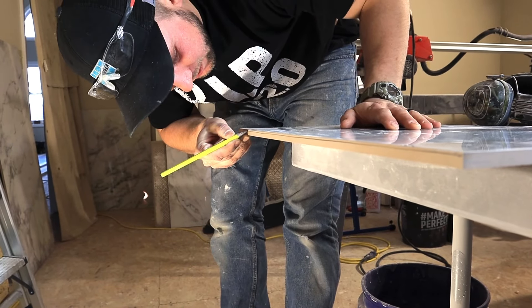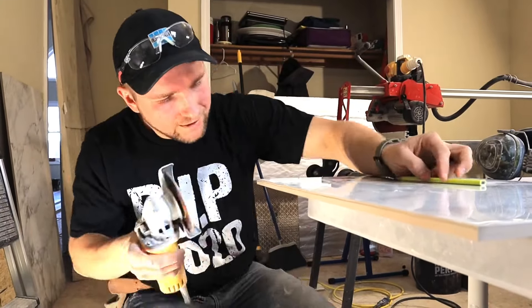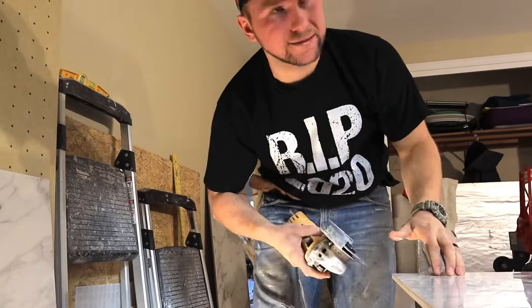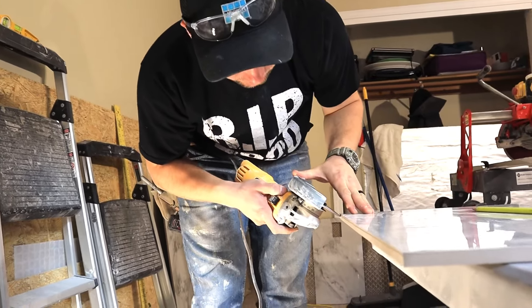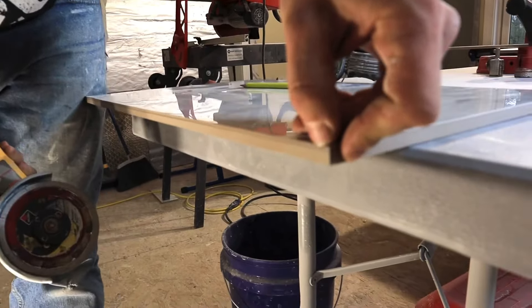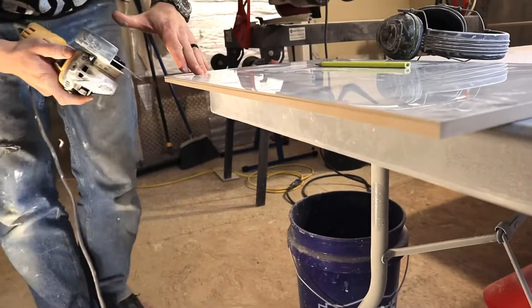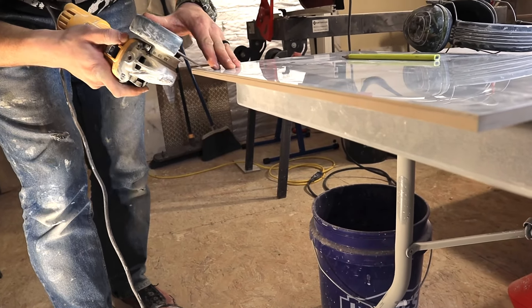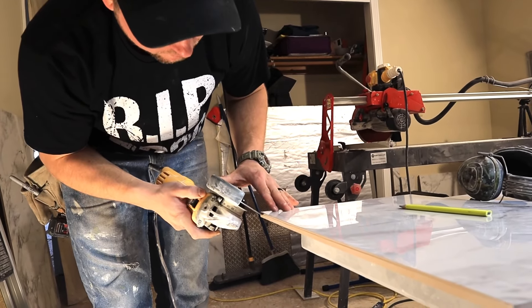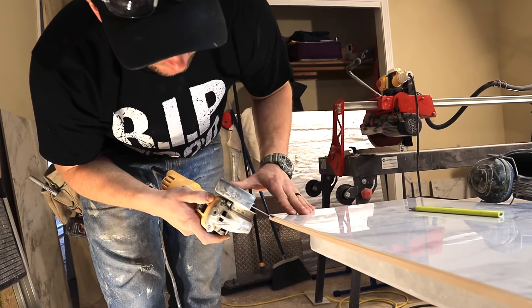I'm going to make that cut with my grinder. First thing I do is put my finger right here — you have to have a guard for this because it helps you stabilize it. I'll come in and score it first, leaving about an eighth of an inch of meat on there. Then you plunge it and make your miter. As you're plunging, keep the pressure away from the finished edge — if you pressure toward the finished edge it will chip, but if you pressure it down more, it chips out to the bottom.